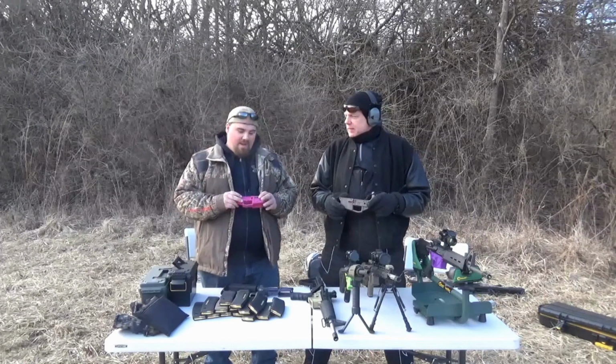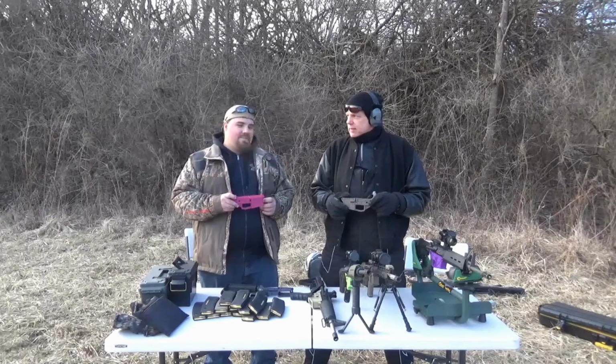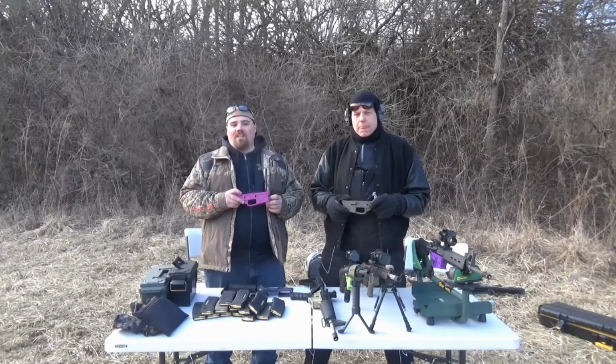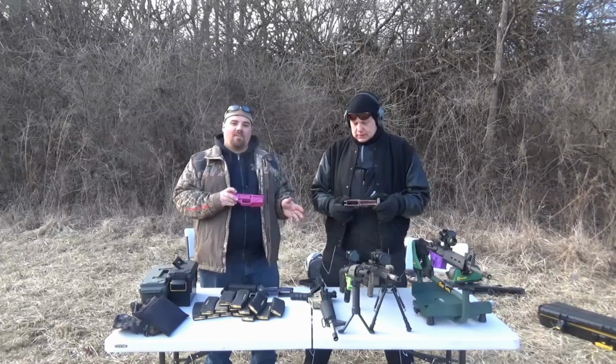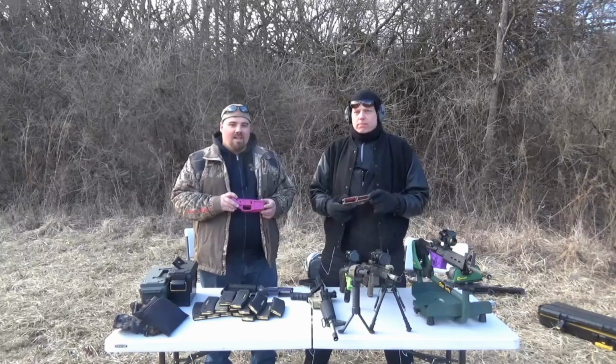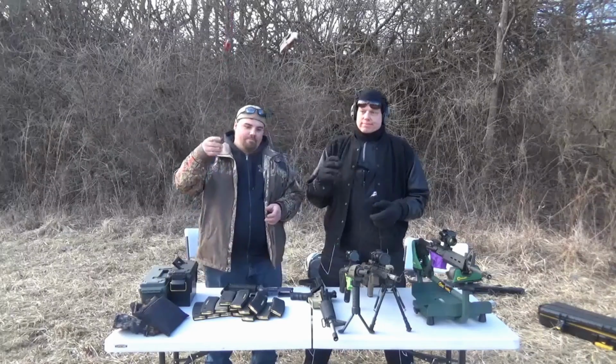Cerakote and Durakote both adhered very well to these lowers, but one problem we did find is don't even try to lightly dust them with the sandblaster, because it just takes the surface off and you're left with little air bubbles. They look like foam. And they look bad. So you know what? We'll get back to these a little later.